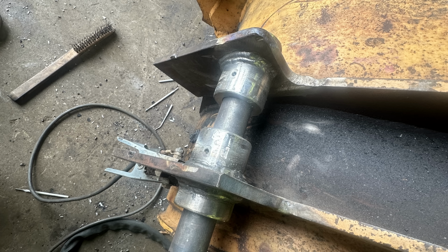So the smarter thing would have been to weld the bushings to the plates off of the bucket, and then spend 5 more minutes to make sure that where the plates welded to the bucket was exactly flat and parallel side to side, and then just weld them on. I'm not joking, it was a pain in the you know what trying to weld the backside of that bushing with almost no clearance. I was using like quarter rods in order to get it, and the TIG torch wouldn't have fit in there anyways, even if I wanted to.